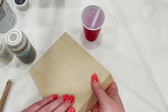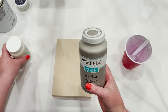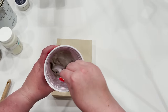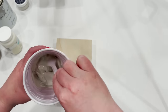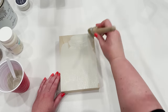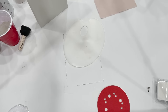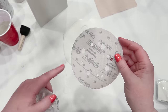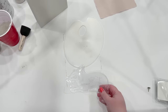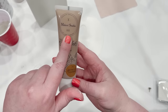The next project we're working on is this little wooden plaque. I'm going to put a little bunny on it, but first I want to get it painted. I'm using Waverly chalk paint in the color Mineral and I decided to lighten it a little bit, so I added a little bit of Plaster and mixed those together. The next thing I wanted to do was create my art. I'm going to use this little bunny stamp from IOD — Iron Orchid Designs. It's the first time I'm using this stamp, and it recommends you scuff up the art side with fine sandpaper. I'm using 120-grit fine sandpaper and just lightly scuffing up my bunny, which helps make sure the ink adheres really well when you go to use the stamp.